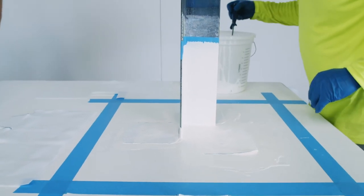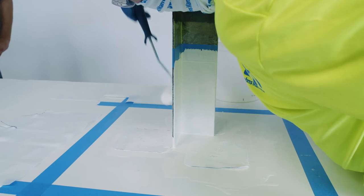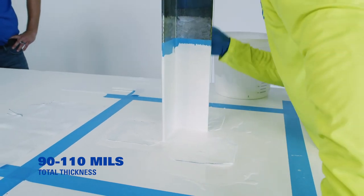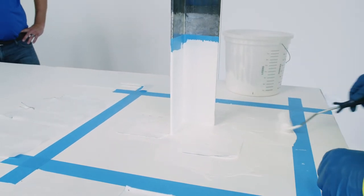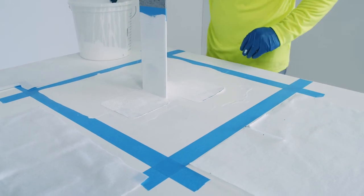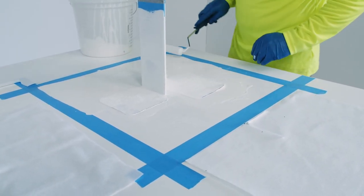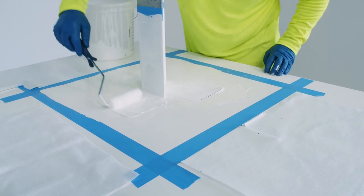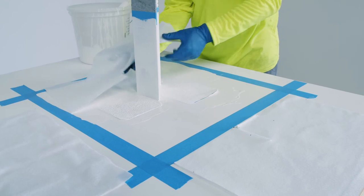Temperature is going to impact the cure period a little bit. We're targeting 90 to 110 mils, and if for some reason you're unable to reach that, you'll probably want to come back and put a second coat on as a top secondary resin coat. As we're building from the bottom up, you want to make sure that any fleece you put down gets saturated. You want plenty of thickness of resin coming out all the way to the tape areas so that you get good encapsulation as it comes through there as well.